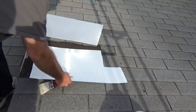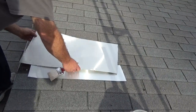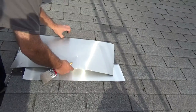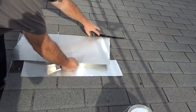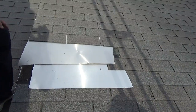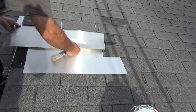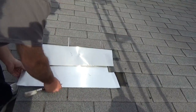So it'll be kind of like that. And then, depending, probably under these all the way up until I get in there, so it would slide underneath here. And I'd work my way. Yeah, you could just tell by the way these shingles are that. So you want to get it above this up that seam. Yeah, so it'll be something like that. So once again, anything that comes off of here, get it up high enough so it just keeps going and going on downhill. You want to make it so that your downhill is working for you.